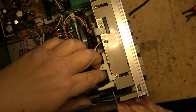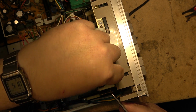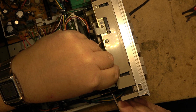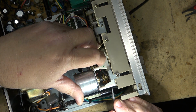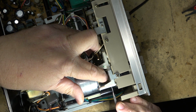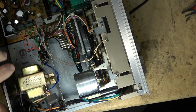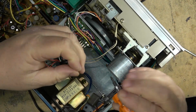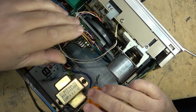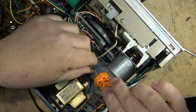I always like these tape decks where you don't have to take the whole chassis out, where you can fish belts around without disassembling. There we go. Okay, that's in place. Let's get that screw back in, and then we can test this one and see if I made an improvement. Probably have to reset the speed because the belt is a little different tension, so